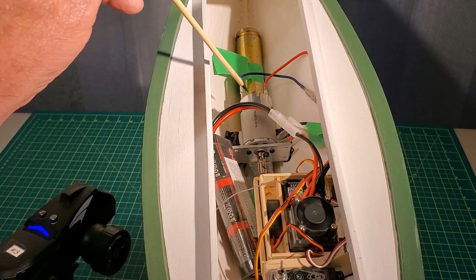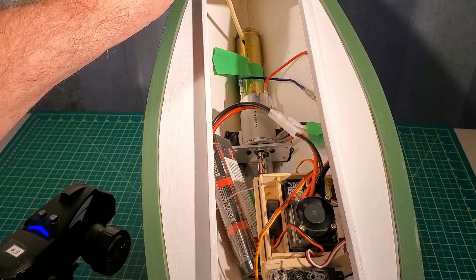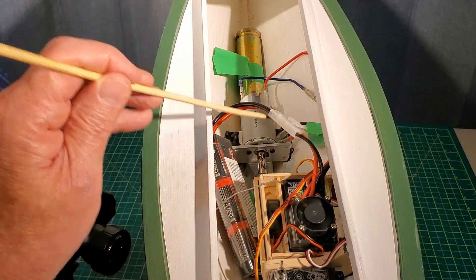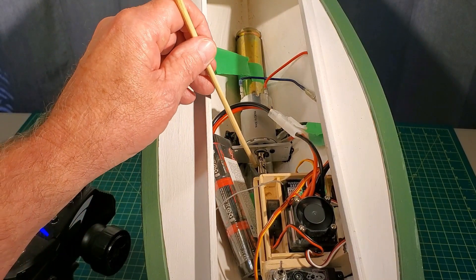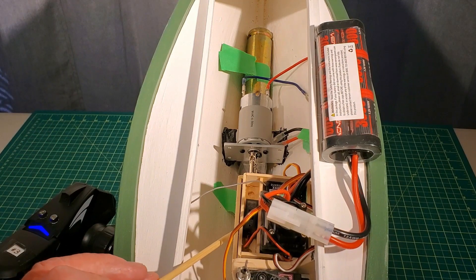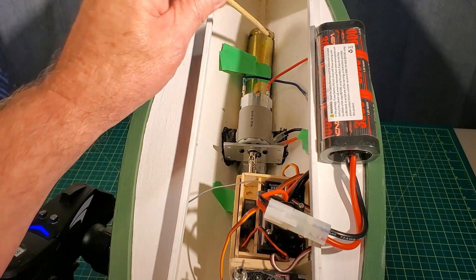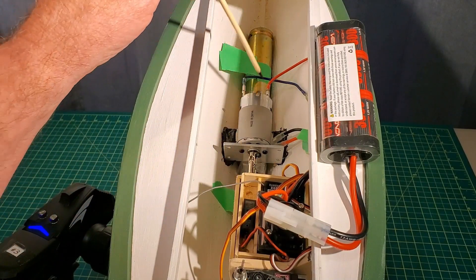Forward, I've got a large cylinder pin that I picked up from a farm supply place. It's 1 inch in diameter, solid steel, and it weighs 3 pounds. I located a single motor mount high enough in the hull so that the 1 inch cylinder can slide beneath it. Just under the universal there's another 1 pound weight, and further aft, just under the pod box, I have another half pound weight of square steel. I can always remove any of these pieces and slide different formations of weights under the motor mount and along the floor of the keel.